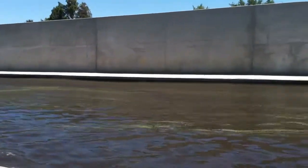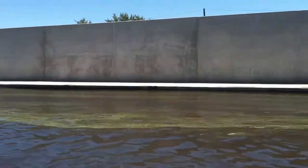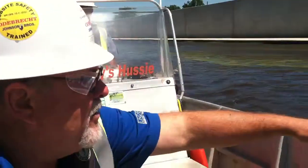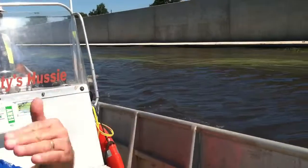They're 35 feet deep to keep the water from coming in and seeping under it. And then you have H-piles that are driven on a batter that way, and you have an H-pile that's driven on a batter this way for lateral stability.